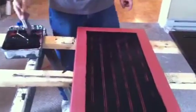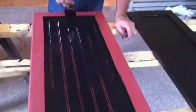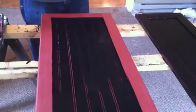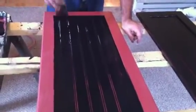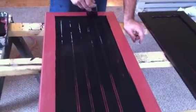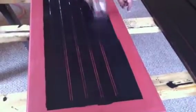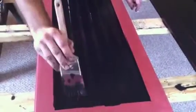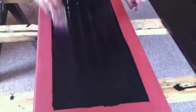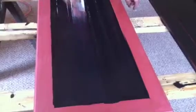on my brush. One of the most novice things about painting trim and things like that, of people who really haven't done a lot of painting, is they don't put enough paint on their brush. And so they end up dragging paint around and leaving lines. And then you always want to paint back onto your own strokes. Long, smooth strokes. So a lot of times you'll get your base, which is a little bit thicker, and then you can just brush it out. But don't play with it very much, or you'll end up taking your lines back out.